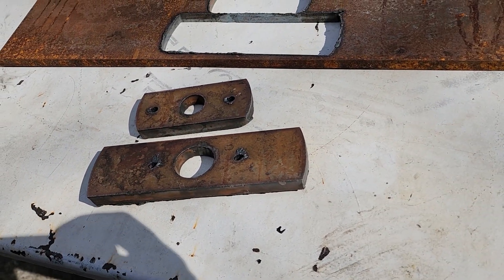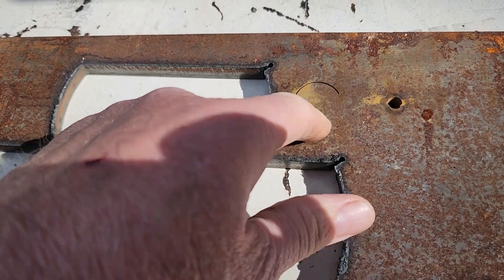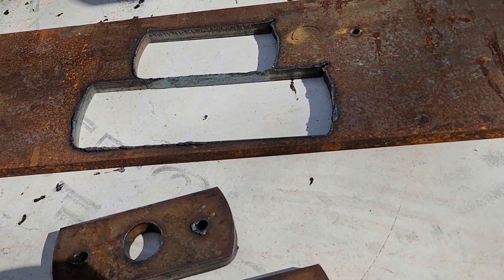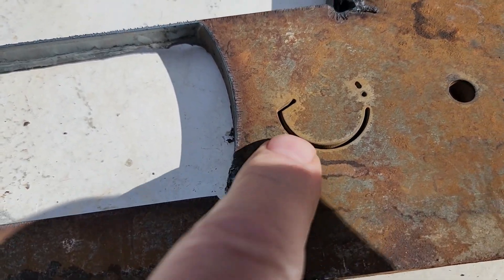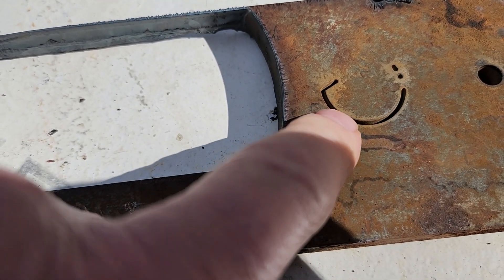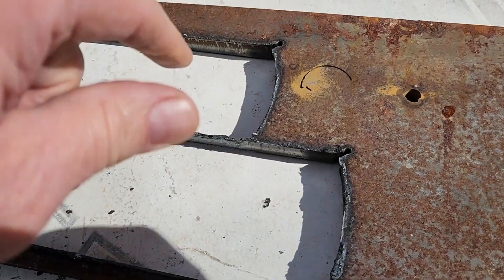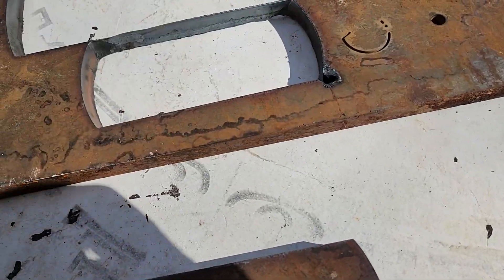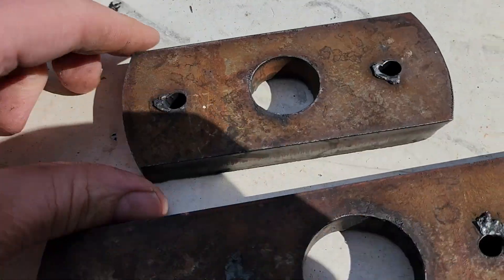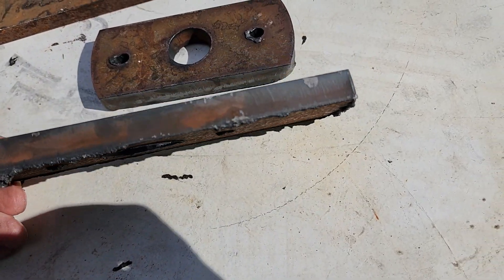It was going to take an hour and a half to cut it with a water jet, but the holes would have been a lot cleaner. Here are the water jet holes — very clean holes. But the water jet failed, so you can see the kerf size difference. This is on the top where the water jet is taking a wider curve; here on the bottom it's very small. And this is the top of the cut — you can see it's angled in on the side there. That's actually going to be good for my application. I was actually counting on that.